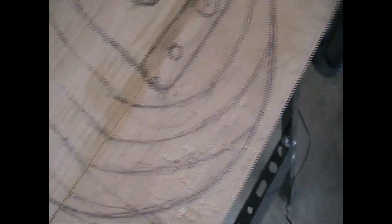It's Colin back again, and I'm going to bring you some new guitar building stuff. I'll show you an LP style guitar. I'm going to graduate the body right now. I've got these lines in, and I'm going to do each section a couple of millimetres at a time, then cut out the shape of the body. I thought it might be easier to cut out the graduation while I've still got a rough block, then cut out the shape.